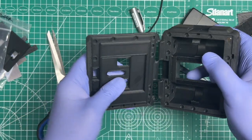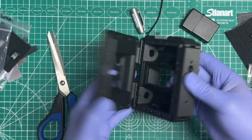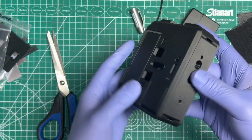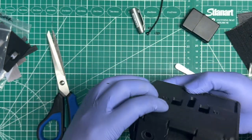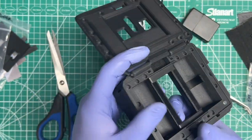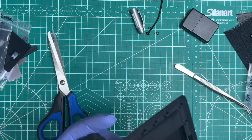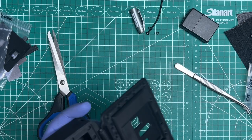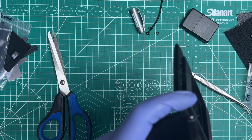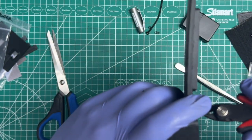And the next step is just to move the door until you feel like it's closing properly. Wiggle it around so that the hinge works well, and that should be it. If you do notice that you're having some issues, then that's probably because the cap is a little bit too fat. So you can grab your cutters. I think cutters works best. The X-Acto knife, probably not as good. And then go in there and just clean it up a little bit.